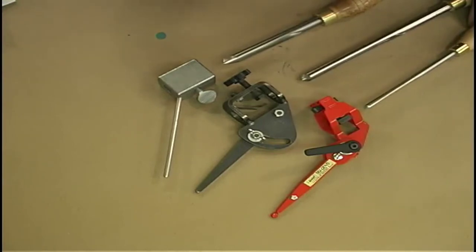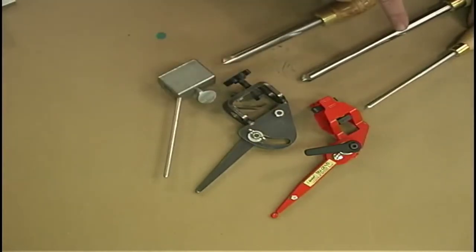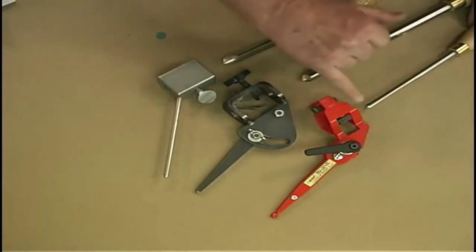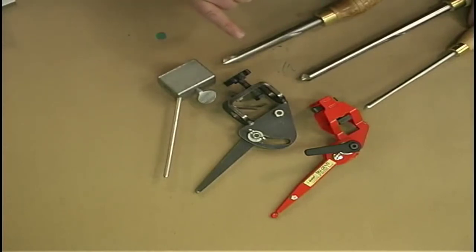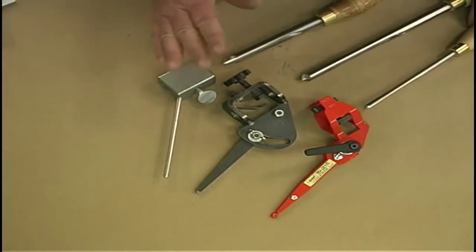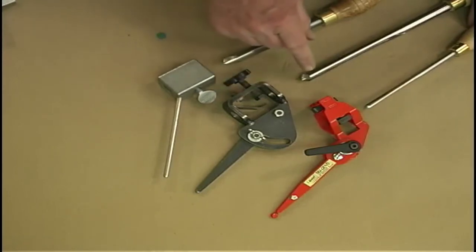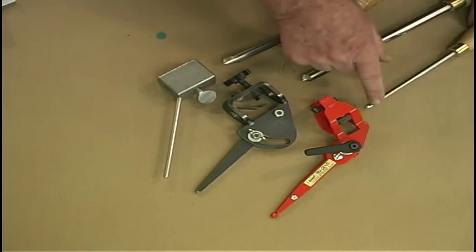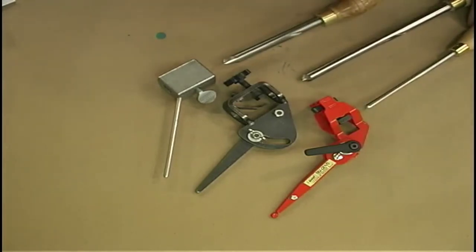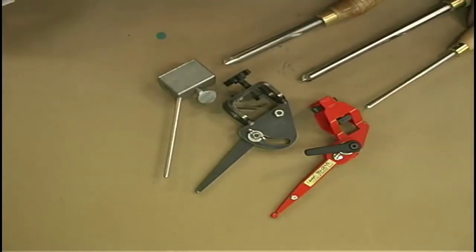The point I want to make: if you look at the foot — the angle of the foot in relation to the position of the chisel — this one is very severe, which means it has to roll quite a bit. That's what pulls back this wing so far. This one pulls back the wing very little, and this one pulls it back just a little more. The main thing I'm trying to get across is: utilize that foot to get what you need.